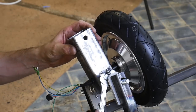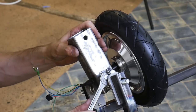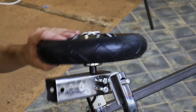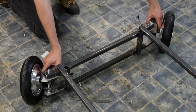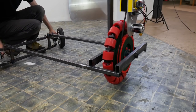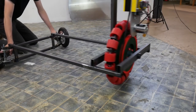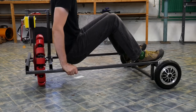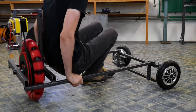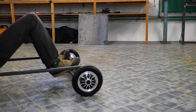Now we can fit the hoverboard wheels which bolt in — they've got a flat on one side of their shaft and I've got two nuts welded onto the metal to help reinforce the tapped hole. Those wheels look like they're going to steer okay. We still need an actual steering wheel, a steering column, and a lever on the end to drive those two levers and get the right angles for steering. At the moment the back wheel is passive and can be pushed around, so it will drift however we want it to, and eventually all three wheels are going to be powered.